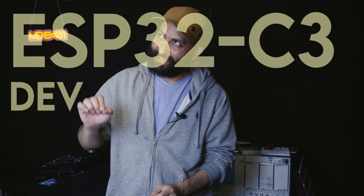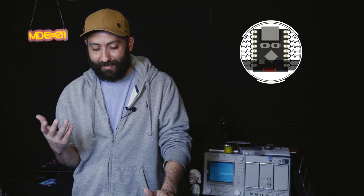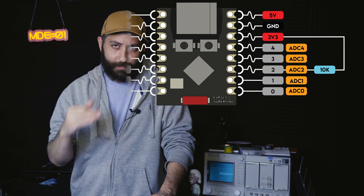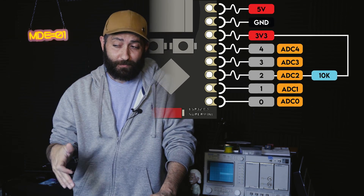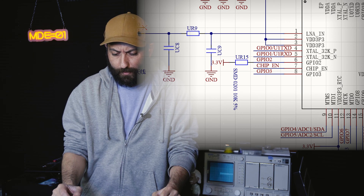If you want to join in and can help with whatever, please join. These off-the-shelf PMG sensors are quite cool. I noticed today that the ESP32C3 dev board super mini variant — the ADC on pin 2 is reading at 3.3 volts. I'm assuming that this dev kit is probably sampling the actual voltage of the microcontroller. I did not see that in the documentation, and that is why in engineering you really do want to read the documentation. This is a lesson more for myself — hopefully you can learn from my mistakes. So I'm going to reroute pin 2.